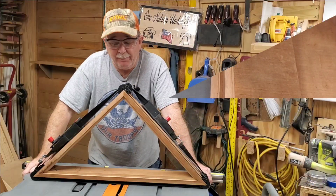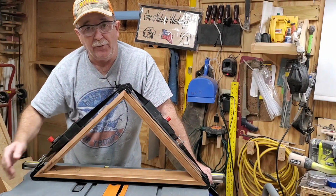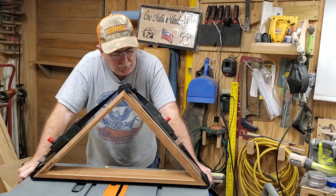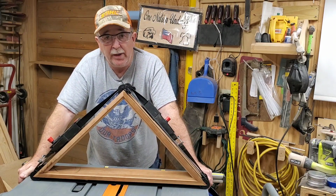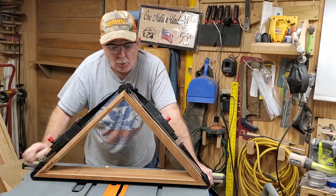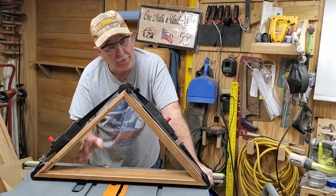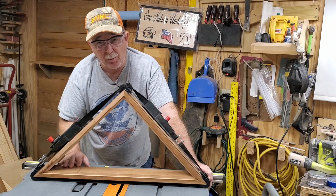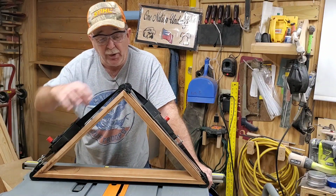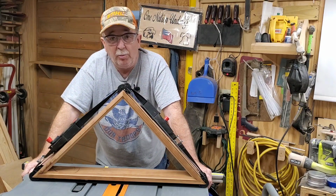All right, we've got the rabbets cut all the way around on all three boards. It's a perfect fit for the birch plywood that I bought to make the backer board out of. So this is going to be a wrap for Buckethead video number 3. In video number 4, I will be sanding the inside and getting that all done, because obviously I can't sand down in the corners when it's all put together. Then I will glue up the edges, and like I said, I'll glue the little wedges on the side so that I can clamp and get a good squeeze. But that's all going to be in the next video.